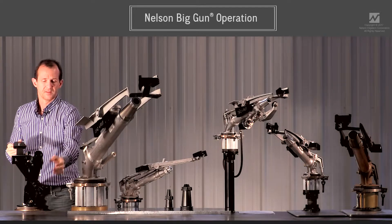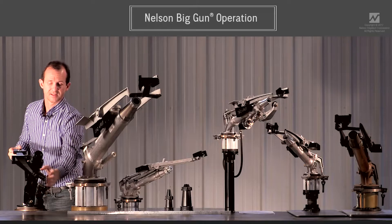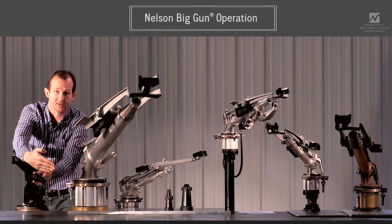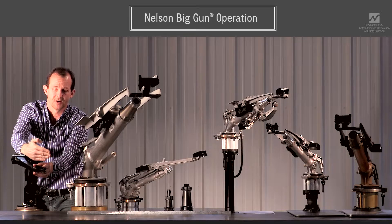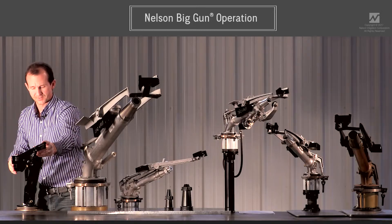On a full circle, the drive spoon itself is actually adjustable. You can loosen up one of these nuts and adjust the angle. The more you adjust the angle this way, the harder it drives. The closer it is to parallel with the water stream, the slower it drives.